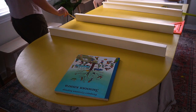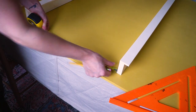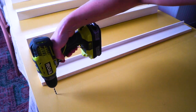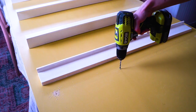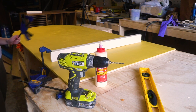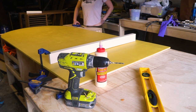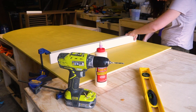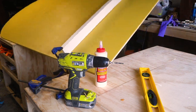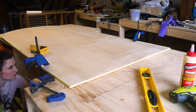When it was all painted, we had to assemble the shelf — and let me tell you, it's actually so much easier than it seems. To assemble the bookcase you'll need clamps, screws, and wood glue. We already measured where the shelves will go, so it was easy to place them and then drill four holes through on the places where the shelves will be. I added wood glue to the shelves and clamped them to the arch plywood back. After that I flipped the whole thing over and drove screws through the pre-drilled holes. Easy peasy! My absolute favorite clamps are the ones by Irwin — I'll leave the link below because they work magic.